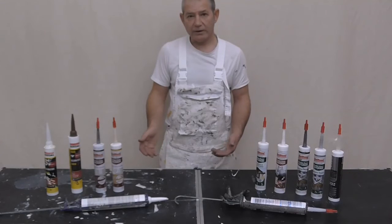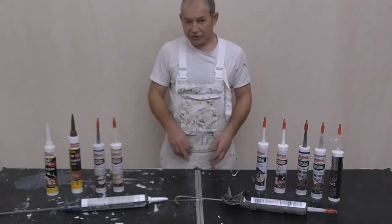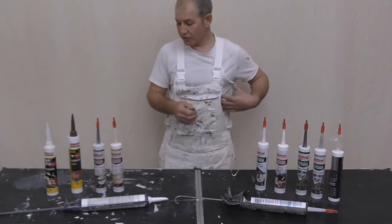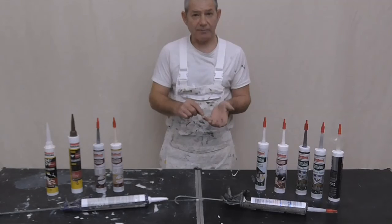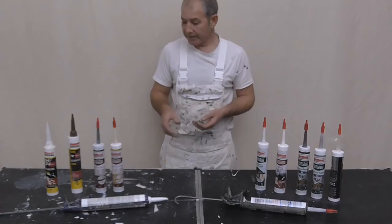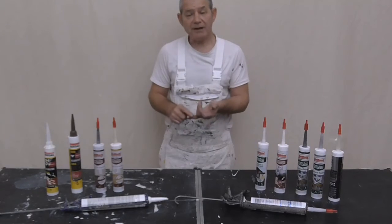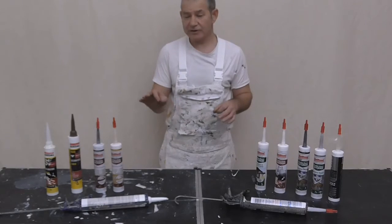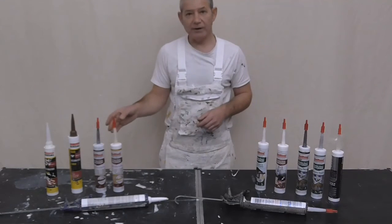When it comes to filling any cracks and gaps, ensure there's no movement - because that generally is what causes these to crack or fail. Either that or the wrong type of paint on the surface; you'll need something flexible. Do your paint before or after using caulk. If it's bare plaster or bare wood, prime or mist coat first, or seal the plaster with whatever plaster sealer you're using - that way this will bond better.